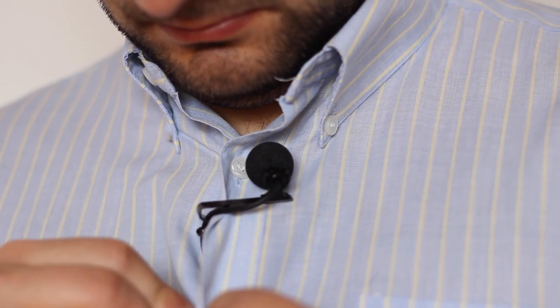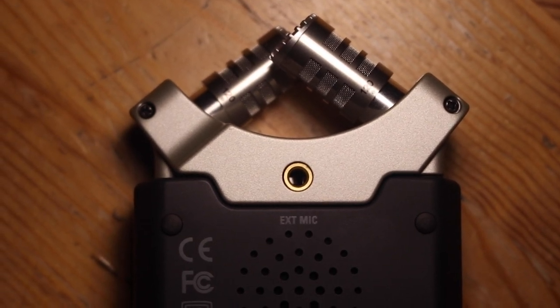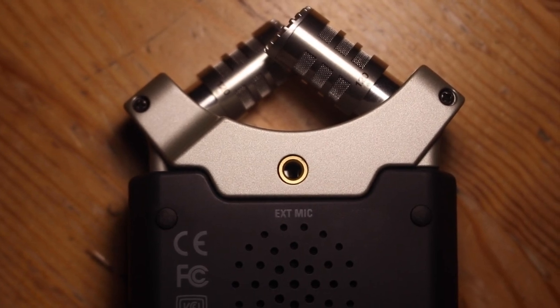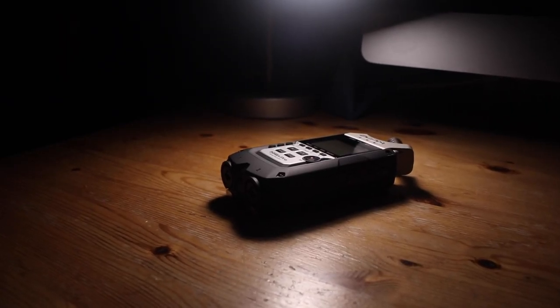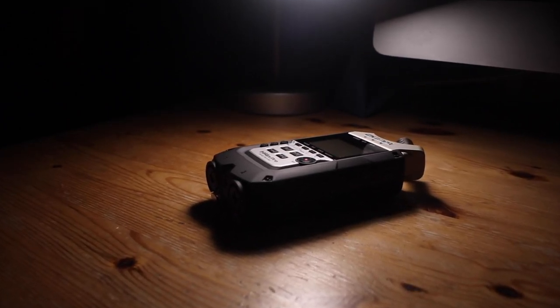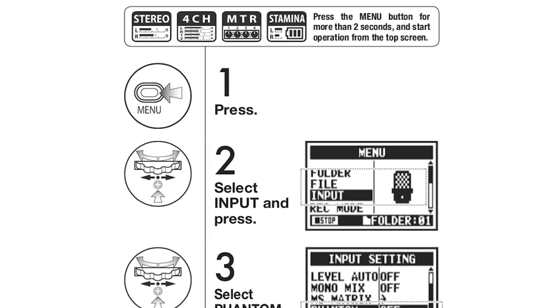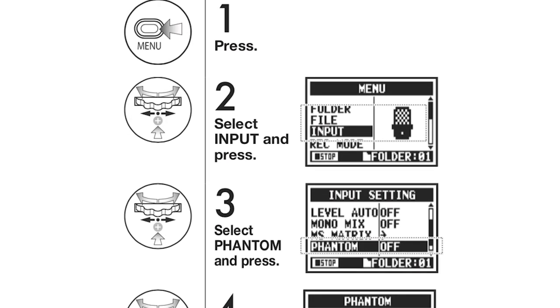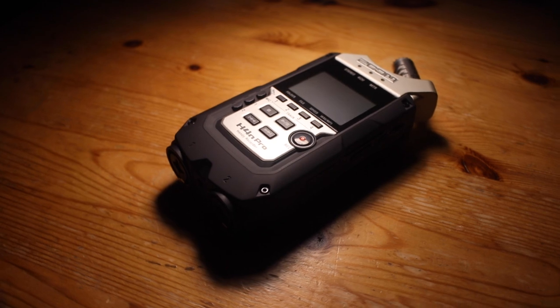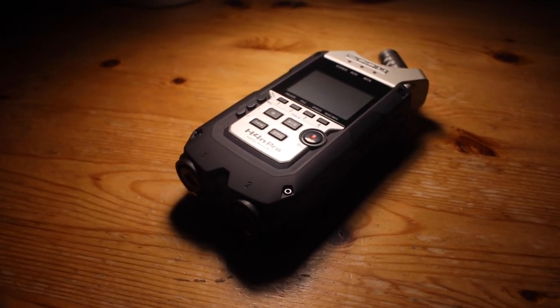This is useful if you need to plug in a lavalier mic in order to record dialogue. On the Zoom H4n Pro, the 3.5mm input is built into the recorder, and it can be found on the back towards the top. Bear in mind that your lav mic might require 2.5V plug-in power, which the H4n Pro can provide. This can be done by going into Menu, Input, Plug-in Power, and then selecting On. The same applies to Phantom Power, if you're using a condenser microphone which needs it. If you have a smartphone lavalier microphone, it has a TRRS plug which will not work with this recorder.